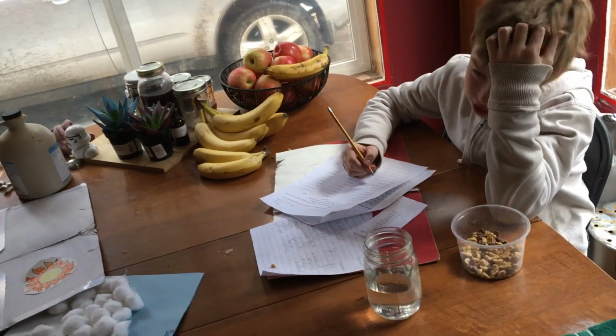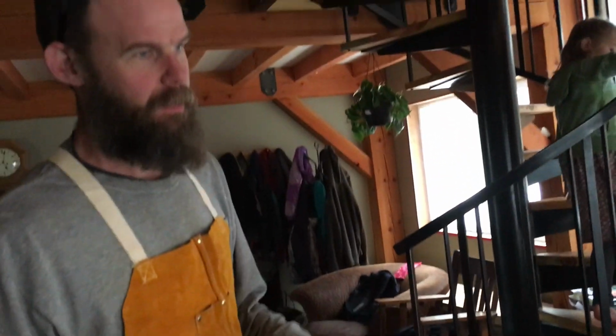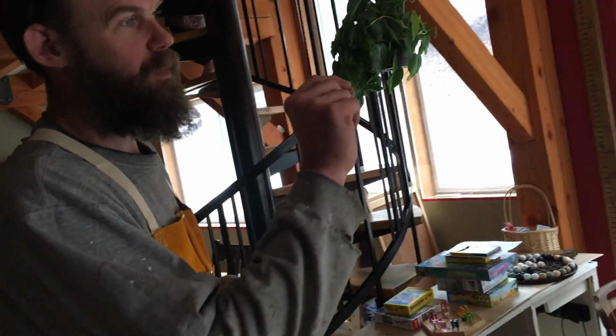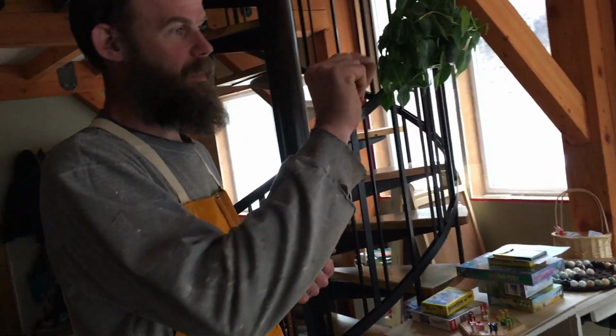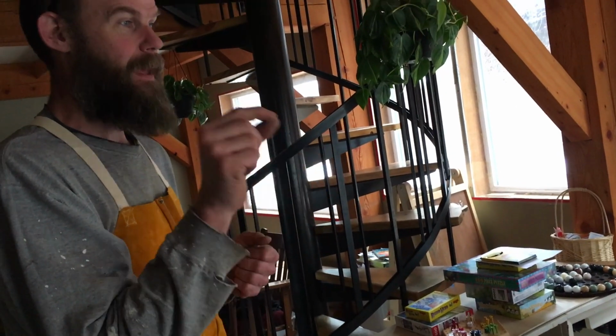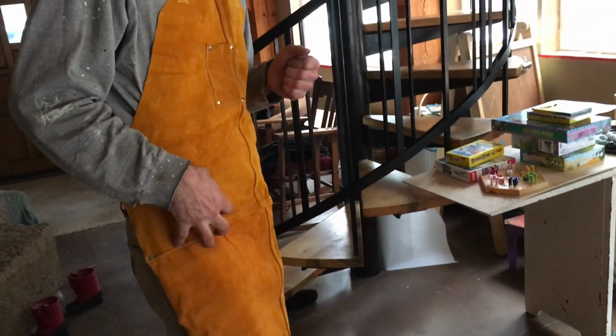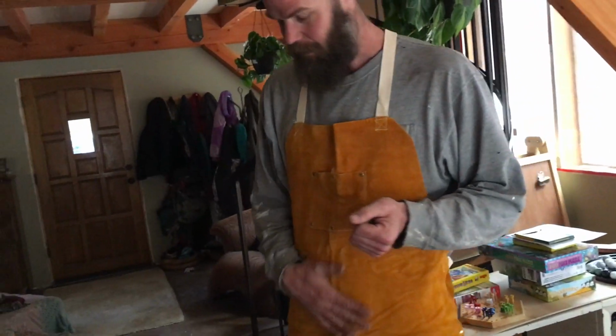Oh, it's the sparks. I thought it was the radiation. It was radiation. It's like from cutting the grinder. From the friction. Yeah, exactly. Friction causes sparks, which causes holes. And every little red dot that's flying through the air is a little red hot piece of steel. And that steel is abrasive. So it's like sandblasting my sweatshirt. And it's hot, so this will survive a little better. Hopefully it doesn't look this bright for very long.